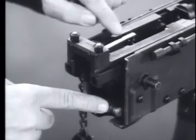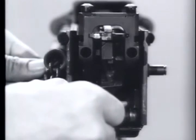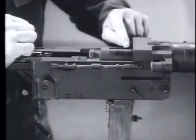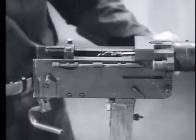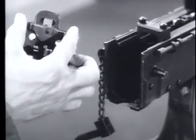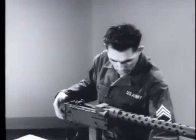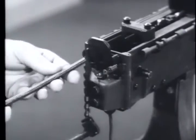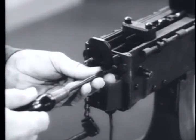When you pull back the action lever, be sure to keep your fingers out of the way of the rammer. The action roller is aligned with the closing cam on the bottom right side of the receiver. The locator slot on the barrel is aligned with the locator. Depress the support lever, then push the barrel extension to battery position — the locator should now be flush. Now with the trigger up, align the grooves on the back plate with the rails on the back of the receiver and drop the back plate into position. Insert the driving springs and guide rods through the back plate into the barrel extension. Push forward and turn clockwise until they lock in place.